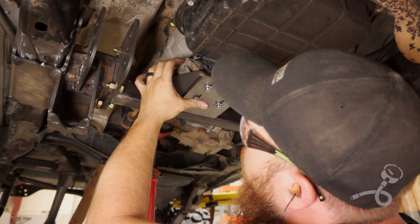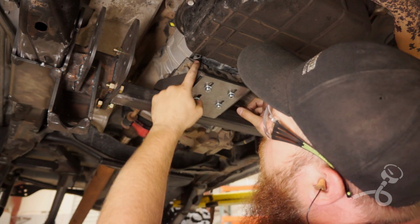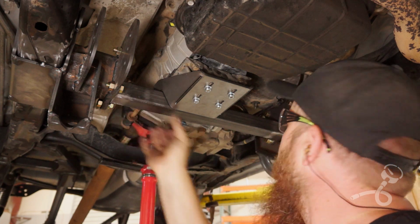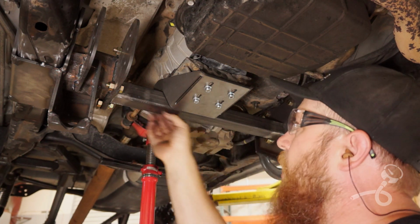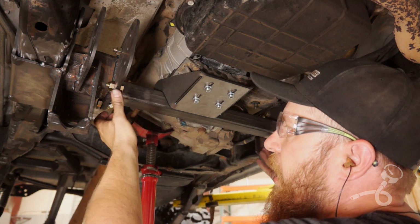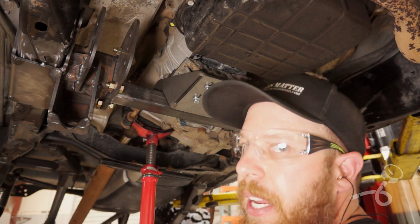They come really close to touching this metal up here, and there's a lot of extra, so I'll just shave it off real quick. No big deal. But this fits all the way up in there with a little room to weld. So if I weld it with it onto this mess, it'll be less likely to warp up since everything's holding it tight.